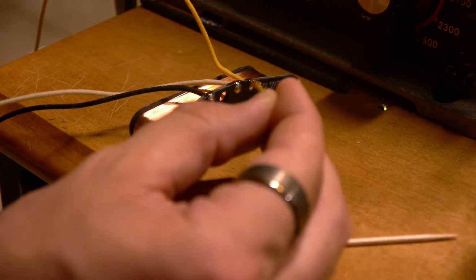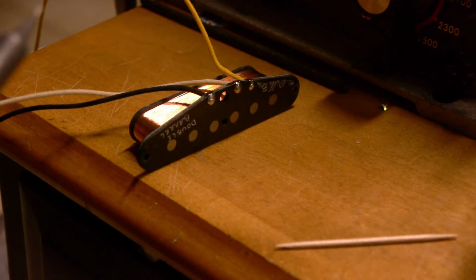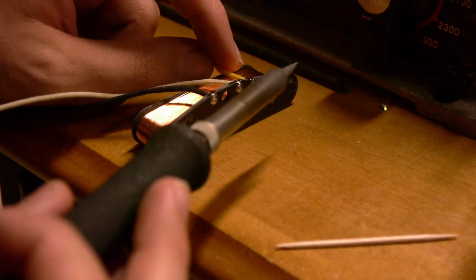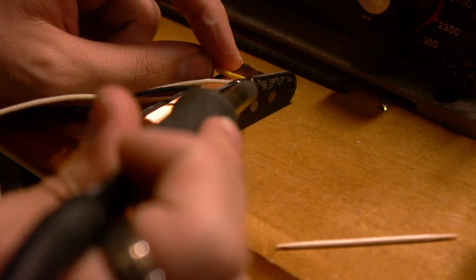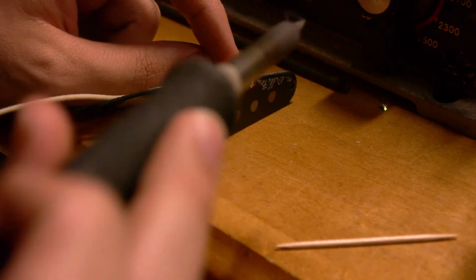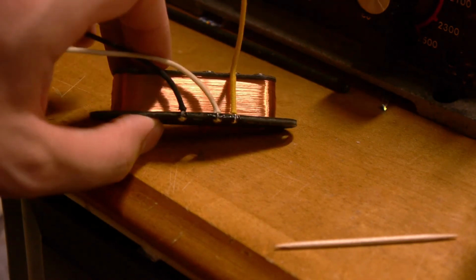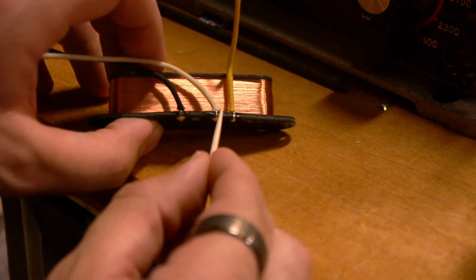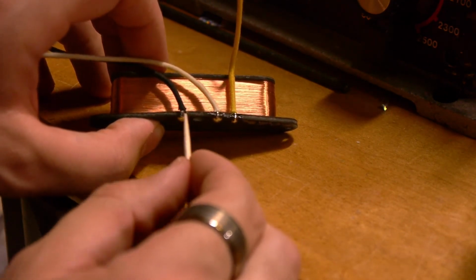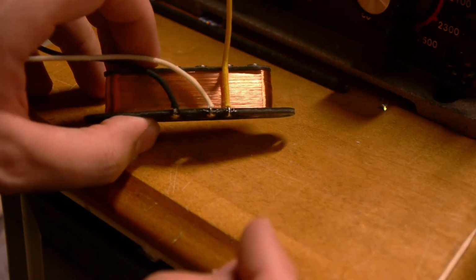And it'll really reinforce that magnet wire tied around the fiberboard, which is actually a pretty common area where they break. You can probably even see it from there. It's all nice and shiny against the flat work now because it's saturated with solder, so that'll be really resistant to breaking.